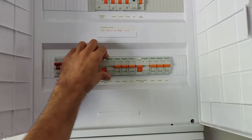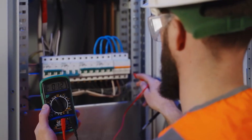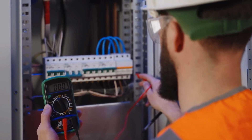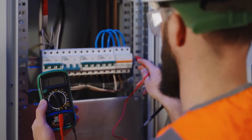At this stage let's assume you've worked out that it is an RCD that's tripping. There are a few degrees of RCD faults you could have. You could have one where it just won't reset at all — this is actually easier to fault find because you get faster feedback. The intermittent faults, where the electrician turns up and the fault doesn't occur while they're there but then happens after they leave, are a lot harder to fix.